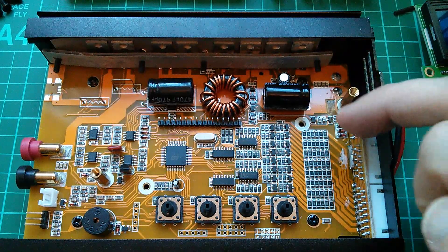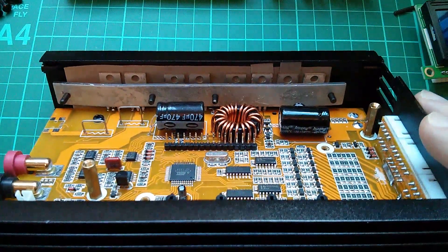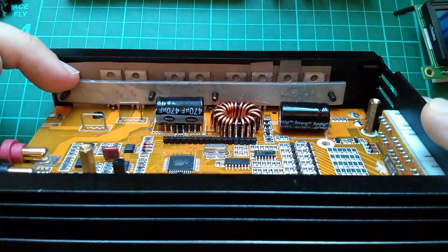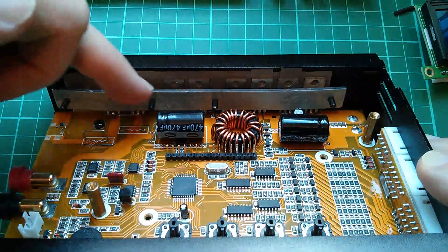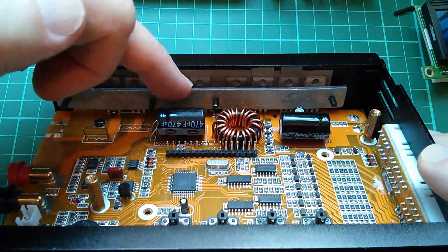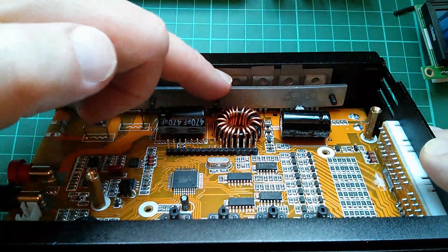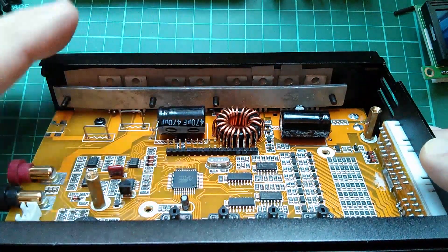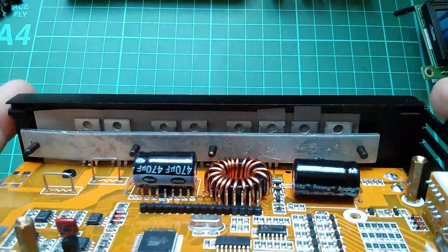This all looks quite neat. These 130-ohm resistors have been put on by a pick-and-place machine — it doesn't look hand-soldered, so I think it's okay from that point of view. I can't see the FETs because they're behind that metal bar, but something rather alarming is jumping out at me. This metal bar is all bent and not pressing evenly against the front of the MOSFETs. Someone has wedged additional bits of heat-transmissive rubber behind two of the FETs — they're just wedged in there because the metal bar has a bow in it. This is really bad.